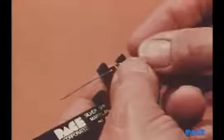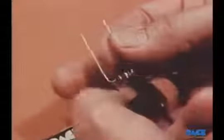For bending the leads, a component forming tool or pliers will be used. It's adjusted to span the distance between the two holes and makes it easy to properly form the leads. After bending, the leads are wiped with solvent to remove oil or grease left from your fingers. The component leads are inserted through the board from the base side, and the fit is perfect.